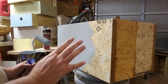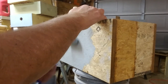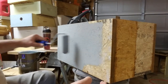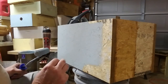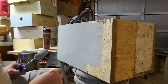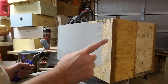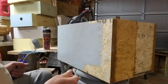Back to this — after it's dried, the second coat I'll do up and down all the way across, which gets every crease going up and down. The next time I'll come back and do it lengthwise and that should get all of them. I'm very particular on the first coat because I want it in every little crack. Then you'll get a little bit on the channel or the top — I just go through and wipe it off with my finger. Like I said, that's glued too. And that's basically it.